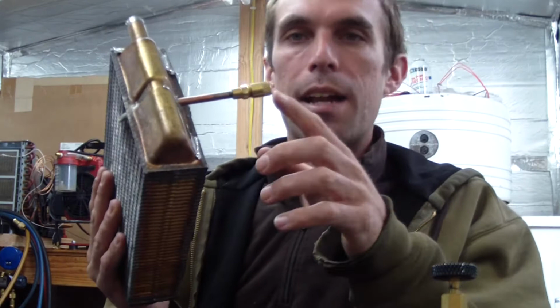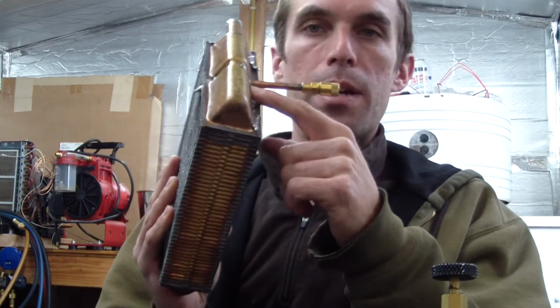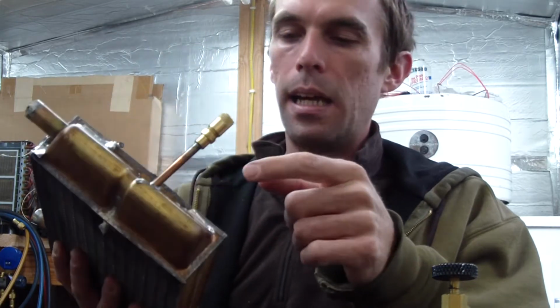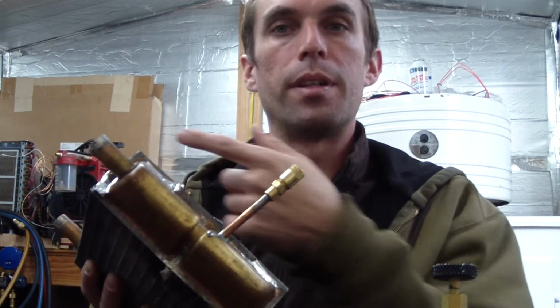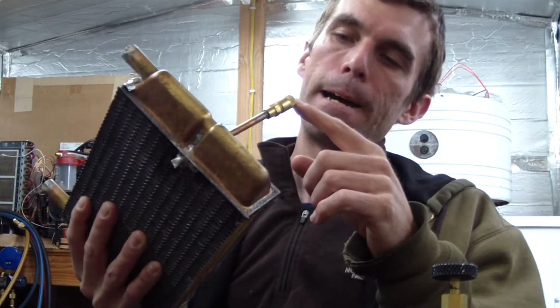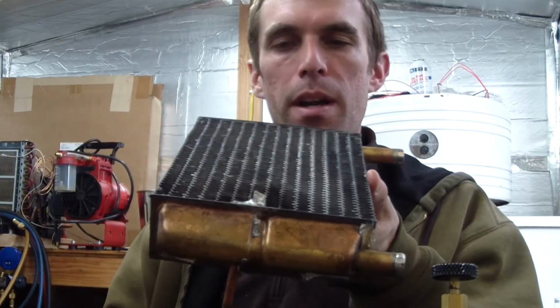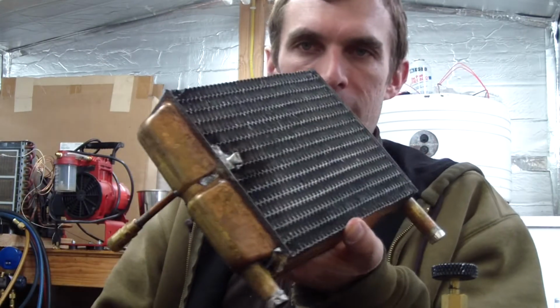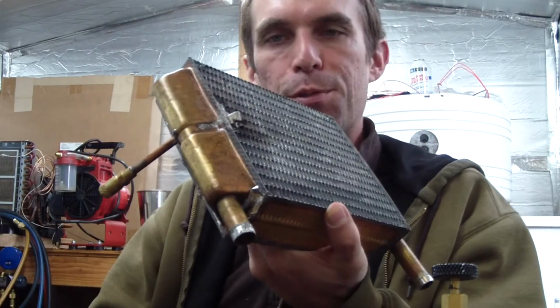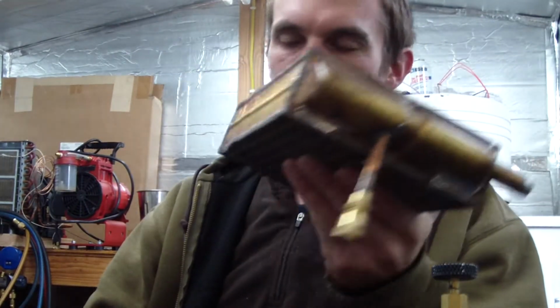I did start to add thermocouples to the head of the condenser in order to measure the vapor temperature on the inlet, as well as the vapor temperature of the outlet of the evaporator, to look for any slight differences there. And in the process of doing that, I foolishly busted a hole straight through the microfins, or the micro channels on the other side, and then dropped it full of solder, eventually sealed it, and still contaminated the thing, and just stupid.